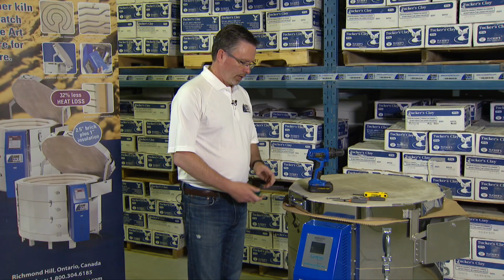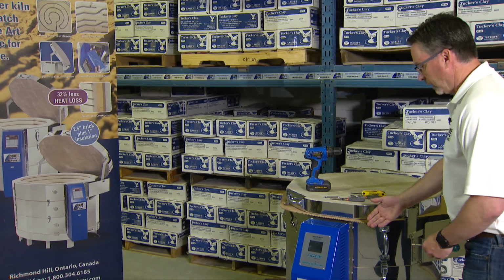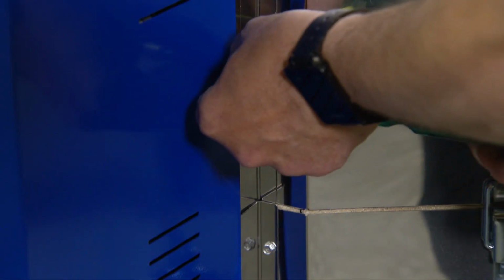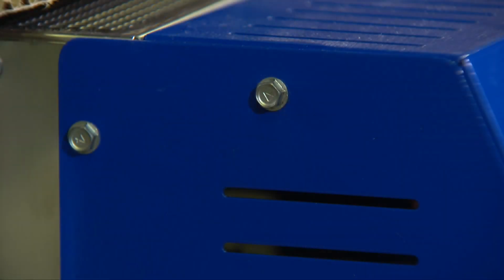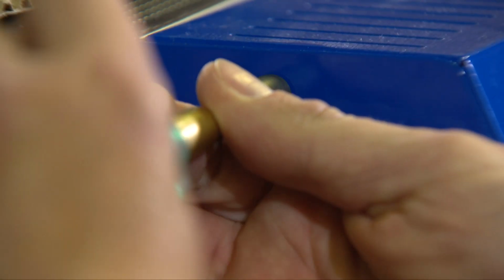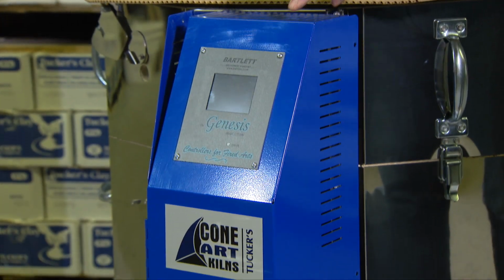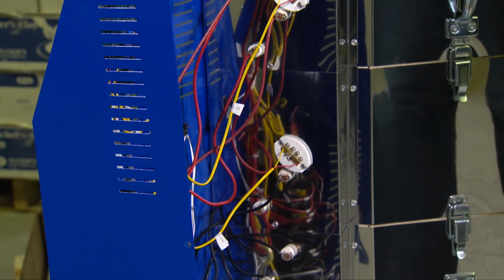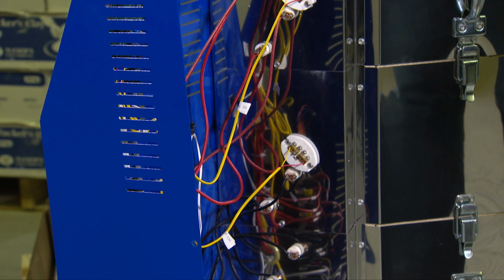Start with the 1/4-inch driver by removing the 3 screws on the right-hand side of the blue panel. Now, remove the screw top left center of the blue panel. This will reveal that the panel is hinged. The entire box will open up and reveal the wires inside.